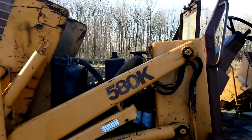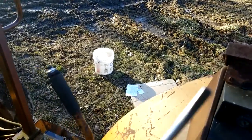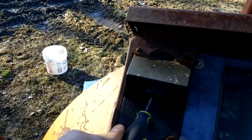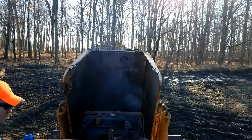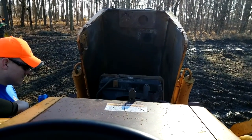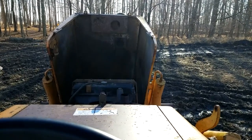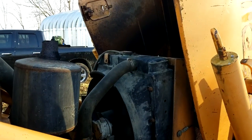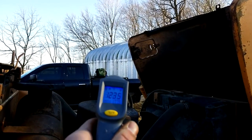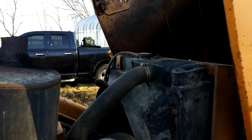I couldn't find fluid, so just adding a little water for now, but gonna give her a start and monitor the temperatures and see how she goes. Now nobody out there come steal my key. Make sure we're in neutral here. I don't quite know if my water temp gauge works or not, but we're gonna find out. So we're working up to temp here still — a little over 200 on the sensor, but I don't think we got the thermostat quite open yet.